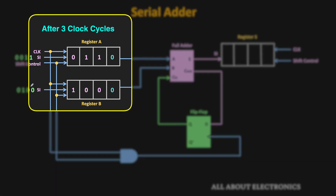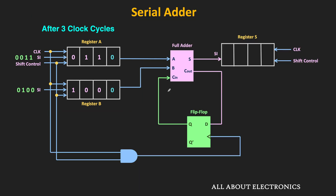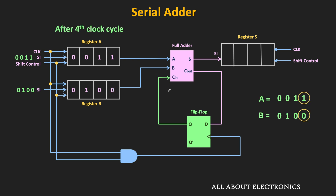After three clock pulses, the content of the shift registers will look as shown. Since the initial content of all shift registers is equal to all zeros, after every clock pulse the sum and carry output of the full adder will also be equal to zero. After the fourth clock pulse, the two numbers will be shifted into the shift register. Now the input to the full adder is the least significant bits of the two numbers — in this case, 1 and 0 — and the carry-in input is also equal to 0, because initially all the numbers were 0.